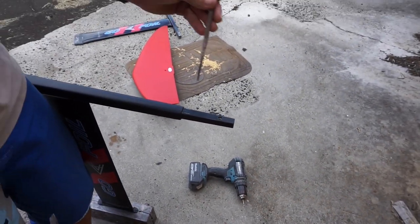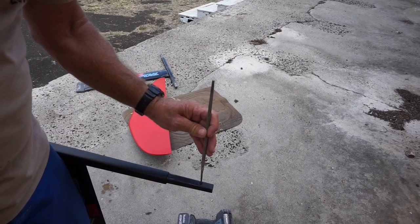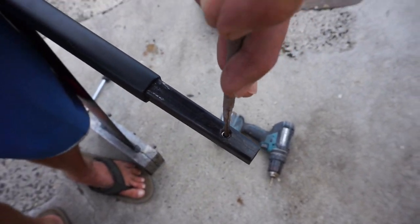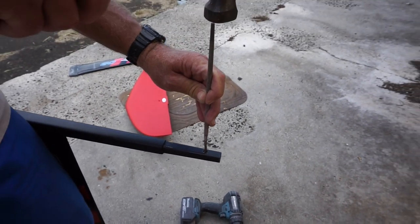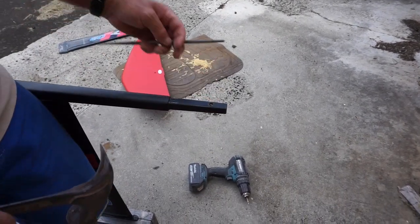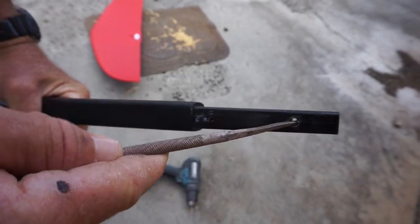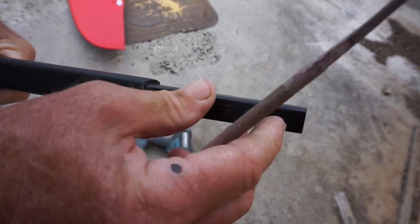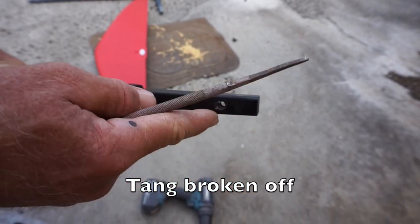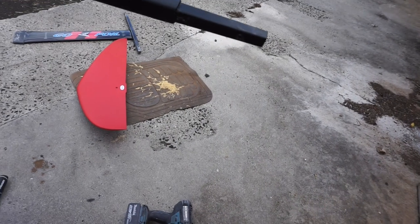Now the way to remove the tang is I put my round rat tail file — it's got the perfect size metal piece to put right on the tang. Put it in there — watch, it's going to go right on it — and I give it one good tap with my hammer. Give it one good tap and that usually will knock the tang right out, or it will be below it so I can look at it from the other side and grab it out from this side. See, that's the tang. This is what the tang will look like when it comes out. Or when I run my tap through there, it will clean it all out and remove this tang at the same time.